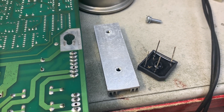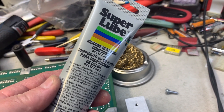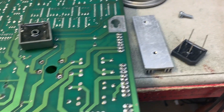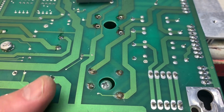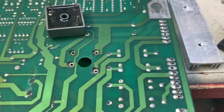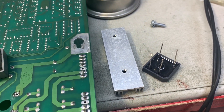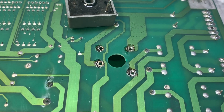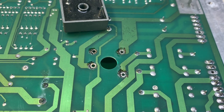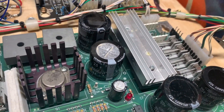The heat sink grease is designed to transfer heat more efficiently from the metal case of the bridge to the aluminum heat sink. If you do not do that, the bridges will run hot and their life will be curtailed a fair amount. When I put this back together I'm going to put heat sink compound on both bridges. I'll screw the heat sink to the existing bridge first, then let the other bridge find a plane it's happy with, because the tops of the bridges have to be in the same plane as the heat sink. Look at all that solder flux left over from the prior work.